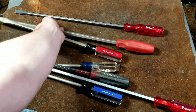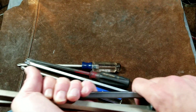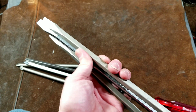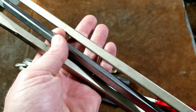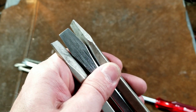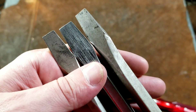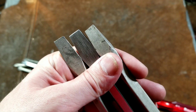Now for a quick close-up of the slot head. Here's an overmolded Rigid USA handle, which has been pretty nice. Compared to the Harbor Freight, the Harbor Freight has actually been just as strong and just as heavy-duty as the Rigid — they both have the same size shank, although the Harbor Freight does have softer rolled corners on their square, which makes it a little nicer to handle than the older Rigid. One thing I mentioned: they didn't serrate the tip on the Harbor Freight. Even if it cost another dollar, these big Harbor Freight screwdrivers are such a good value that even at ten bucks they'd still be a great value. Adding that serration would help prevent slipping whether you're using it as a prying tool, a chisel, or for driving large flat-head fasteners. That's really the one big criticism.